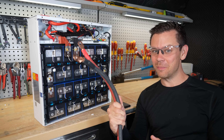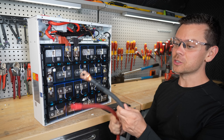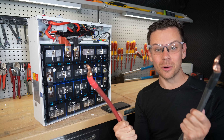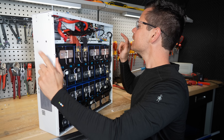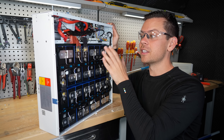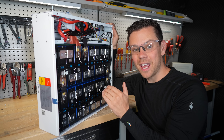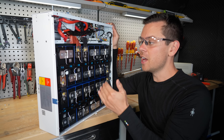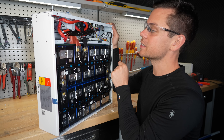So we're going to do something stupid - we're going to charge it with over 100 amps. All my other chargers are taken, so we're going to connect this in parallel with an EcoWorthy battery and hopefully we'll trigger a protection state. Because this BMS does not have an inductor like the other ones, it probably cannot regulate current - it's either on or off. With the other ones it can regulate it down to 10 amps, so it can charge slowly if it connects to batteries with a different state of charge, but I don't think this one has this feature.